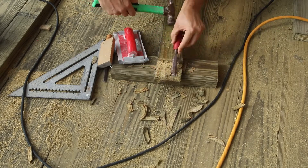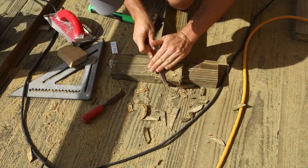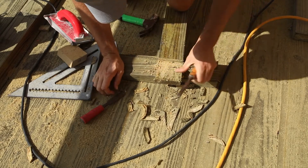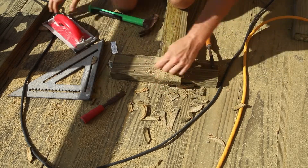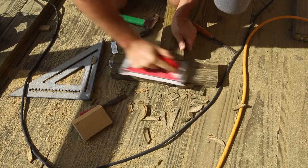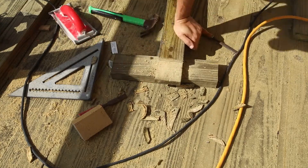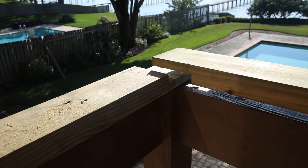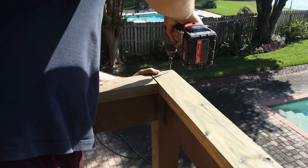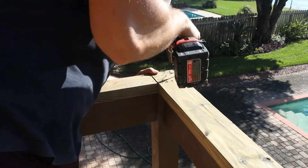I removed any rough edges remaining with a chisel and fine-tuned with an even more delicate chisel. The goal was to get a relatively flat surface — it didn't have to be perfect, since this is a deck railing and not a high-end cabinet project. I finished up the joint edge with sandpaper, which really smoothed things out. I then test fit the joint and it fit great. To secure the joint, I pre-drilled for four screws to minimize the chance of wood splitting.